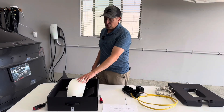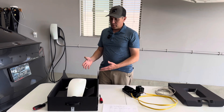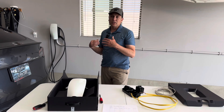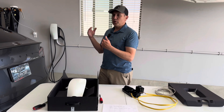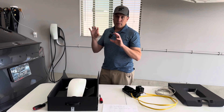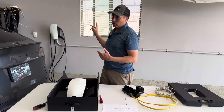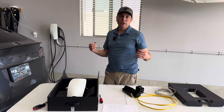The wall connectors are super versatile — I really like the flexibility in the installation. Tesla really made that easy and has some great security settings. If you need to have more than one installed, I'll link my video where I show how I installed my universal wall connector and daisy-chained another wall connector to it, because I didn't want to run two separate lines back to my breaker box — my panel is getting kind of full. Two cars can charge sharing a 50-amp breaker, each getting about 20 amps, and when one is done it gets the full 40 amps.